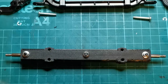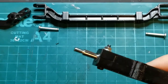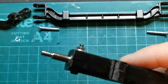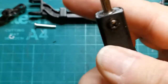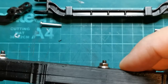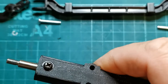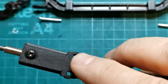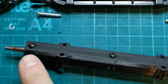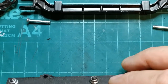We're back. I put those two halves together using the 20mm screws and some grip nuts — one in either end. Bolt them together, and you can put one in the middle as well; it's not necessarily critical but it does hold the middle together quite nicely. I'd recommend that once you print these, you run through the four mounting holes, the two holes either end, and the hole in the middle with a 3mm drill, just so you end up with a nice clear mounting.